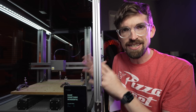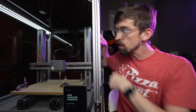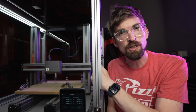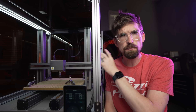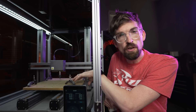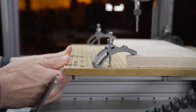That brings me to the hate part of my love-hate relationship with the CNC module, which is just the design of the machine. This is more of a traditional 3D printer i3-style setup where the linear rails are stationary, you have a gantry that moves up and down, but instead of the gantry moving forward or back, it's your work bed that moves. The key difference is that you only have one attachment point from the work bed to either of the Y-axis rails, so you can actually flex the whole bed forward and back fairly easily.